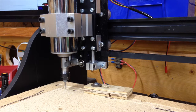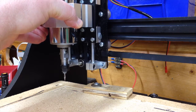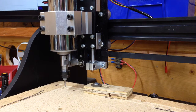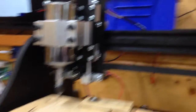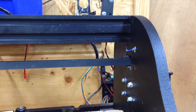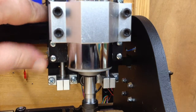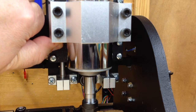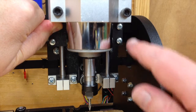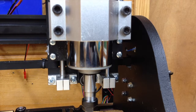I've always tested it by hand with no power to the steppers, with the magnet always in about that position. But when it Z's out, the magnet moves — it's not anywhere near the hall effect sensor when it gets over there. The hall effect sensor is right here, and I've been testing it by hand with it always right about here, but when it does its Z homing it pulls up to about an inch or more above the hall effect sensor.